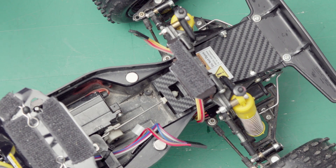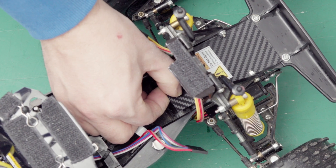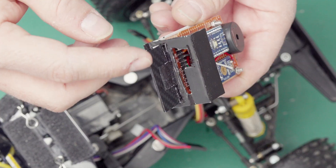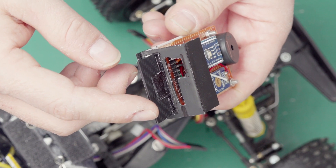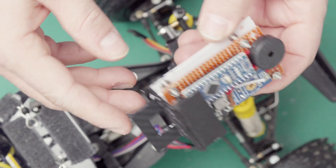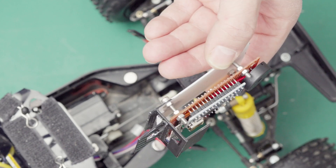There's always the concern of dirt, and I found several solutions to get around this. The Arduino is inside in a small chassis and I made a handle where you can actually pull out, lift that up and pull out the whole unit. The connectors are located in the front and there's also space to plug in the USB directly to the Arduino to update the actual firmware.